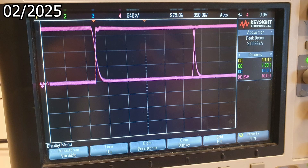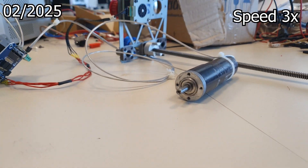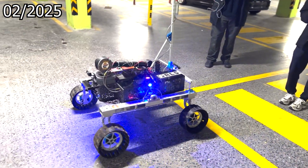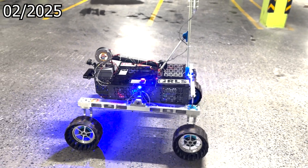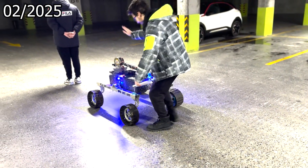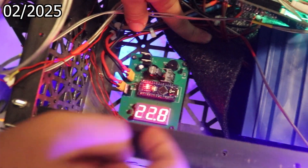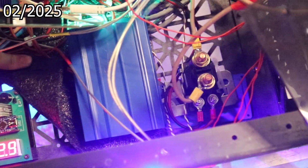We also conducted eye-diagram tests on the line and compared the results to standards. This year, we designed a more compact science board, which contains a high-power DC motor driver, high-precision stepper driver, and other necessary connectors. To power these parts, we designed a built-in buck converter that generates 5V and 12V rails. To enhance rover safety, we implemented a series of protection circuits, including a main fuse directly connected to the battery output, an emergency stop button, and a high-current relay controlled by a custom battery protection circuit. This circuit continuously monitors the battery voltage; if the voltage drops below a certain threshold, the microcontroller opens the relay, disconnecting the motors from the battery.